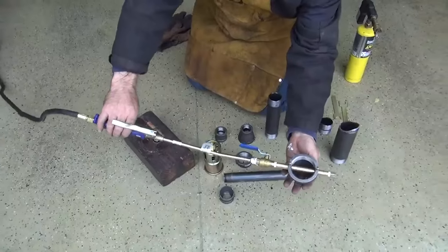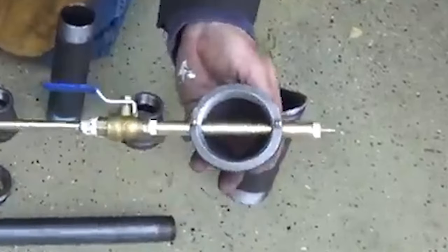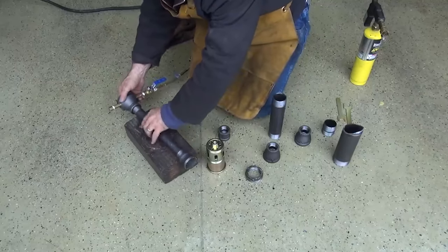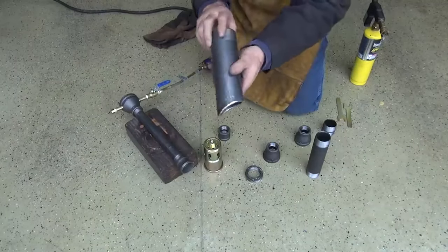To keep the brass tube from rotating, it is important to drill small set screw holes in the back of the 2-inch bell that will come in contact with the brass tube. For the end flare, simply get a threaded reducer and grind out the large part to create a larger and increased flare so that the flame will come out right.